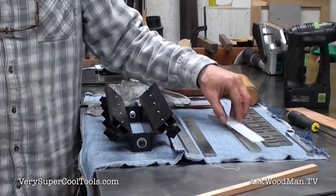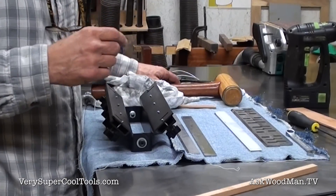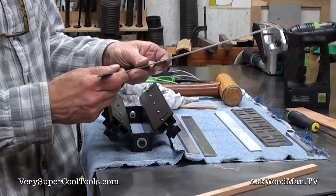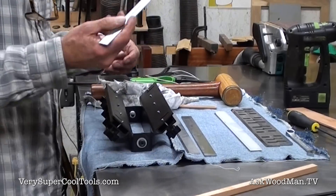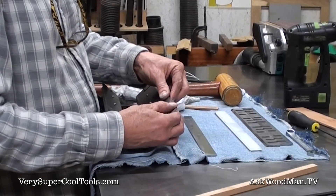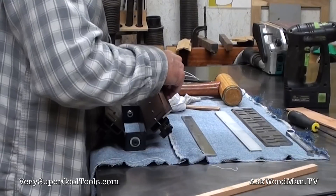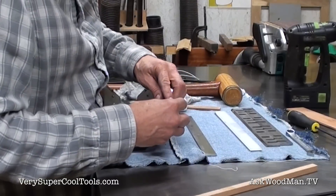I'm going to use this as a dummy. Let's put these knives in right now. I just use a small ruler — this one is a fraction under three quarters of an inch, but for this size it works well. I set it down and bring the knife down to where it's exactly flush with the top of the ruler. The ruler and the edge of the knife are identical. It's pretty easy to do.